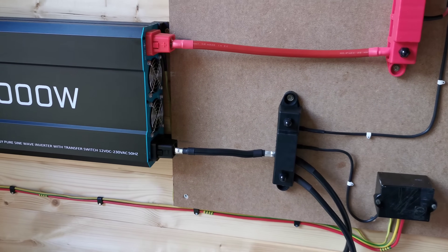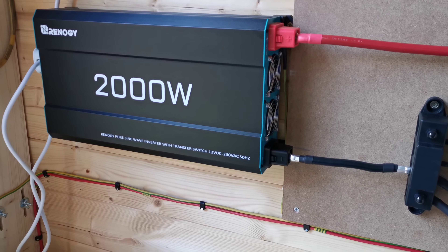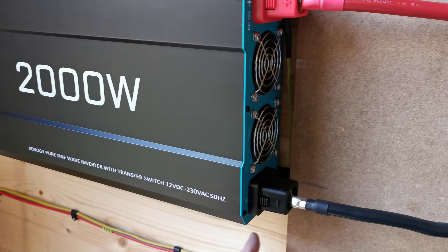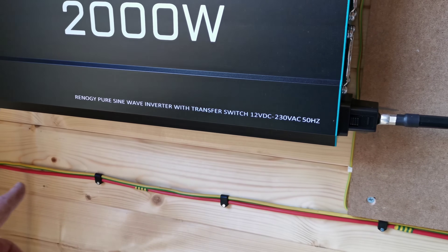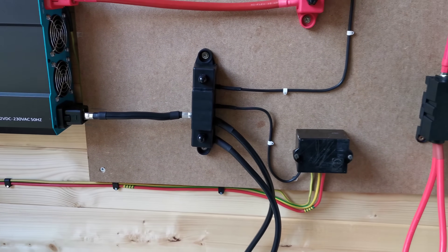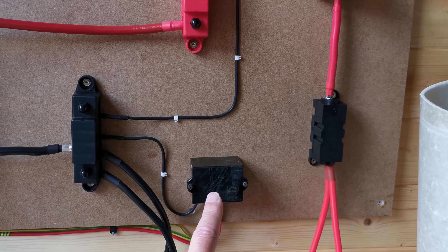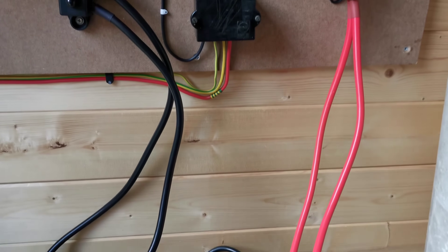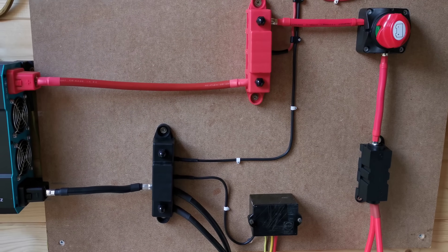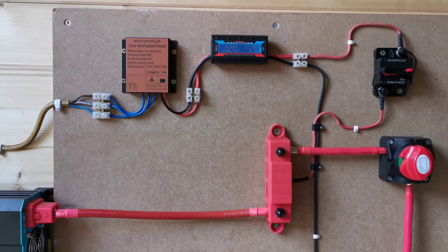Now the interesting bit for some people: cast your mind back to that earth peg. These Renogy inverters — so far it's been working very well — actually have an earth terminal. You can just see under there an earth connection, and I run the earth away down behind me through the side of the summer house to that earth peg. I also put the other earths to a terminal block and run earths from that for the entire system. Earth your system — if you're in a summer house that's important, though I know it's different if you're running an RV or van life setup.